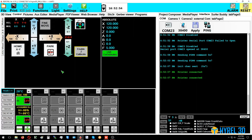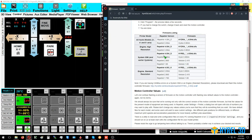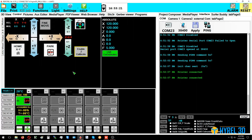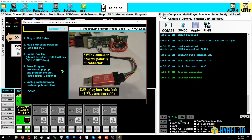Now we have to flash firmware onto the heads and the hotbed controller. Going back to the browser, you can see the steps completed for the motion controller, and now we go to flashing the hot heads and hotbed controller. Connect the ST-link — a USB adapter and programming tool — to the hotbed controller and print heads one at a time. They do not have to be on the yoke. Connect them to the ST-link, connect that to your computer, and flash.